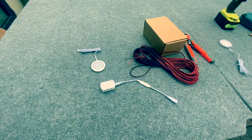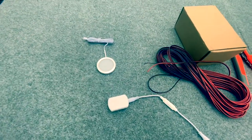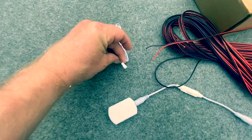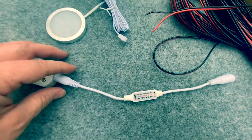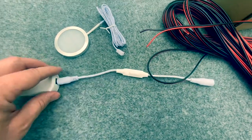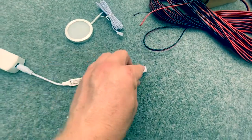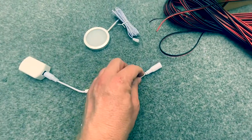On to the LED lights now. These are 12-volt LEDs bought from Amazon or eBay. They come with a control unit — a connection box where all of the individual LEDs are going to wire back to. It also comes with a wireless remote control module. We do want to be able to operate these independently, so they are going to be wired back to the electrics, but when power is running to them we'll also be able to use the remote.